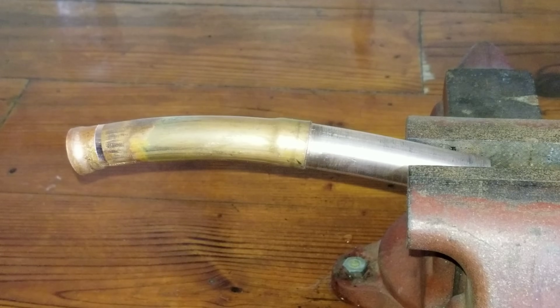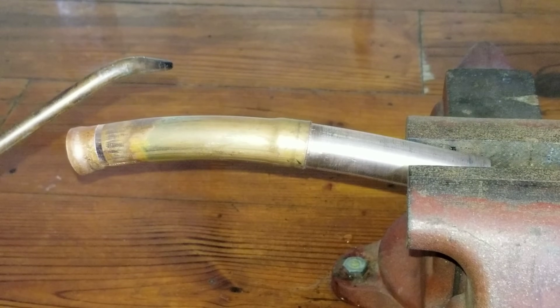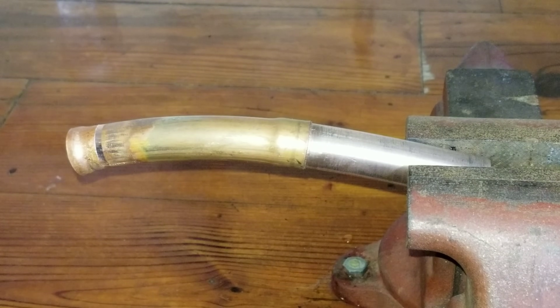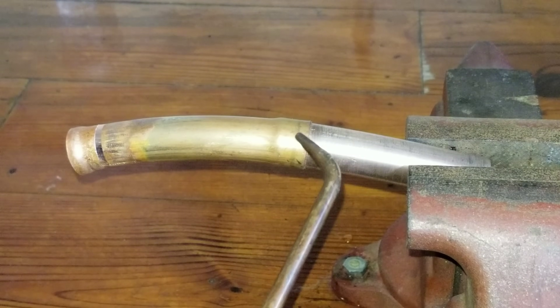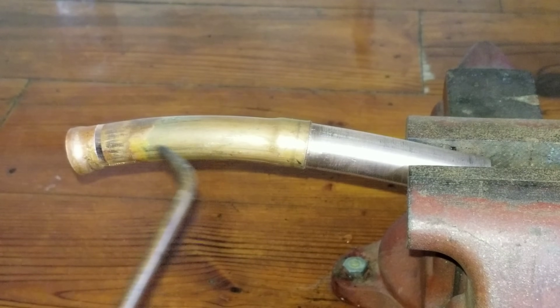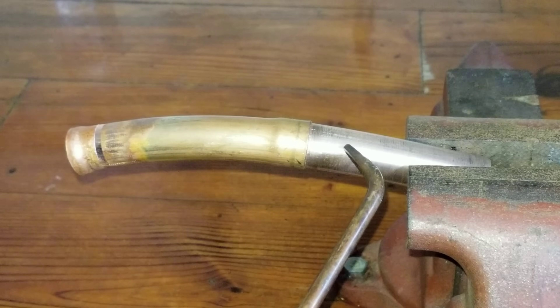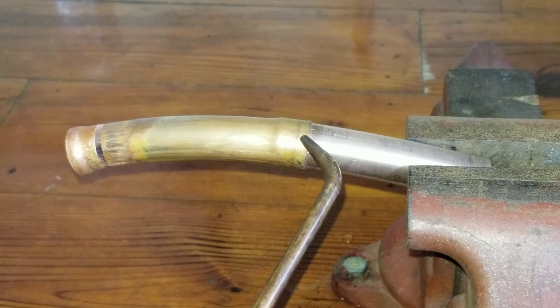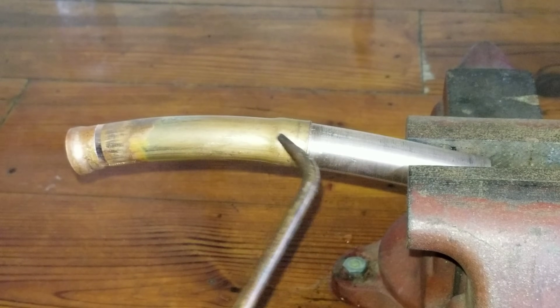What I'm going to do to end this video — I've also had questions about brazing copper joints. So I'm going to show you again how I do it. I'm going to go ahead and light this torch up and just braze this joint right here. This is just three-quarter inch copper with a swage on it. Typically what I do is once I light the torch, I am going to start heating up the piece of copper that is inside of the swage — the fitting, whatever it is. I'm going to heat up the internal piece first.